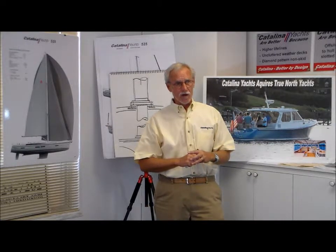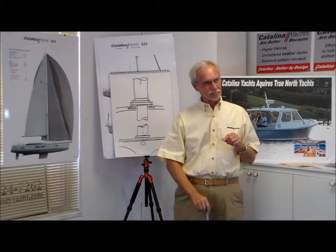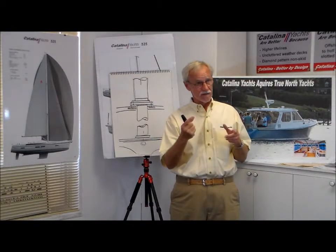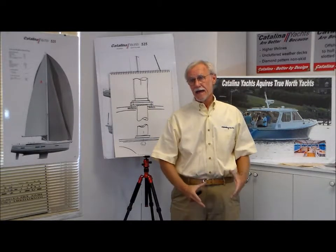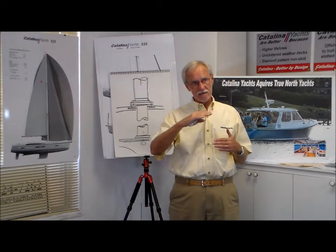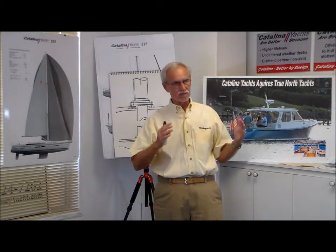So what we thought would be best is if, just like a keel-step mast, there was metal to metal from the mast head all the way down to the keel, just as you'd have with a keel-step mast. The problems with keel-step masts are lots of leak potential around the partners, the mast collar, the mast goes through the deck, and additional noise and moisture and condensation inside the boat. So it's better to end the mast at the deck if you can find some way to transmit all the forces down through to the keel without putting the deck in compression or relying on any internal structure.